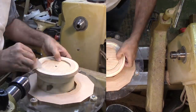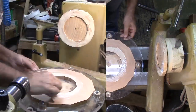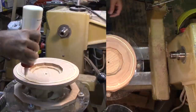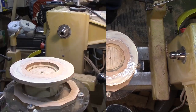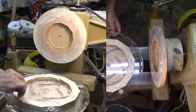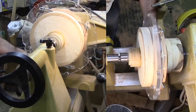Now to glue the remainder of the rings. I'm using a Longworth chuck adapted to use from my tailstock. This centers the ring better than I can other ways. I'll do some rough shaping on the outer edge of each ring to make things go easier later. I do love the long shavings that come from this oak, even now that it is dry.